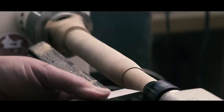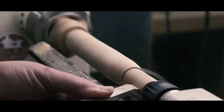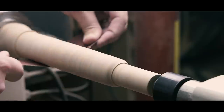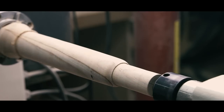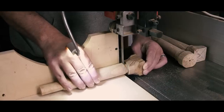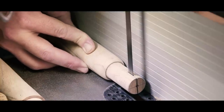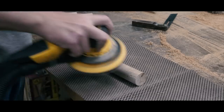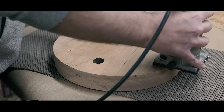I put a small chamfer at the ends of the tenon just to help the tenons into the mortises. I'm using a skew chisel, but I have it turned on its side to use it more like a scraper. After turning the three legs and checking them against each other, I started assembling the stool — or plant stand in this case. To secure the tenons into the mortises, I wanted to wedge the tenon, so I cut a kerf in the end of the tenon at the bandsaw. I used a random orbital sander to clean up some of the tooling marks from the lathe, then put a small roundover around the edge of the seat.